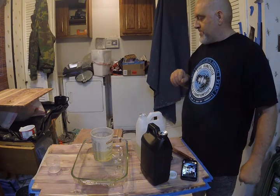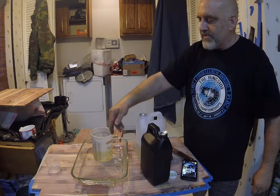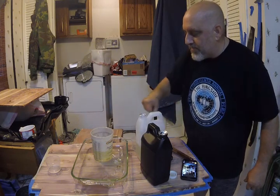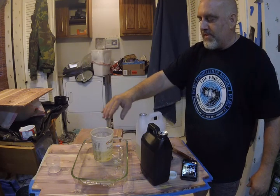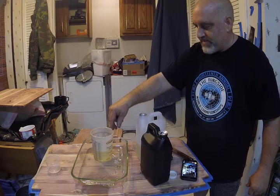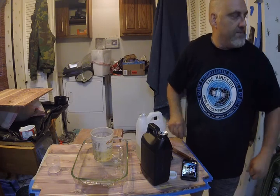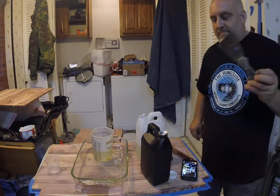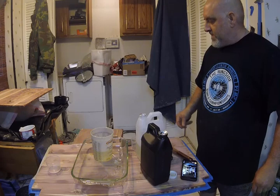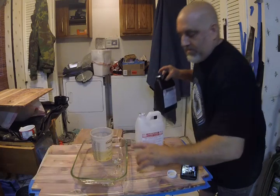The one thing you've got to remember is to put the glaze in the center of the board. In the past I've poured small amounts here, there and everywhere, but then it gets too thick, you have too much runoff, and you waste it. So this time I'm going to put it just in the center of the board, a big old puddle, and start spreading it out slowly with my putty knife. It's more economical that way. All right, so we've got those two. I know I need more. And this is the hardener one right here.